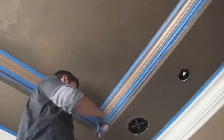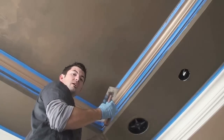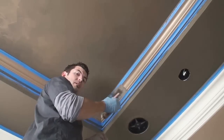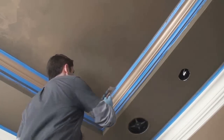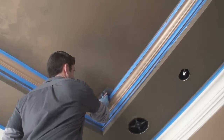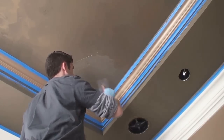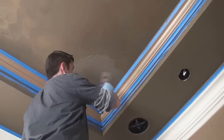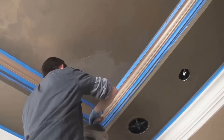I've got my hawk loaded with material, loading the right side of my trowel. When you're troweling, it consists of two strokes: the first stroke is the application stroke to get the material on there, the second is the manipulation stroke. A lot of people try to get it done in one stroke and get frustrated — it looks contrived and messy. I'm going to work out of my corner, stick that edge in nice and tight. I don't want rainbows — I don't want to make the same stroke every time. I want nice random strokes going in a lot of different directions to create the movement that comes through in the final finish.